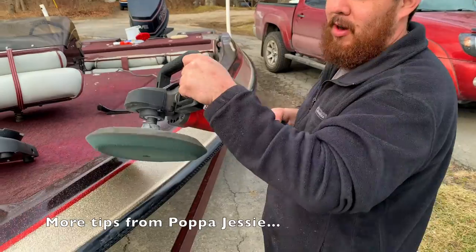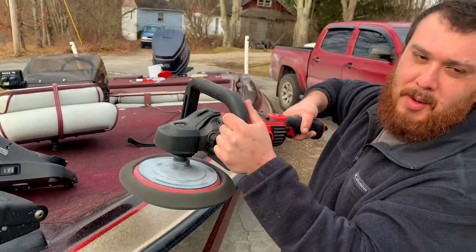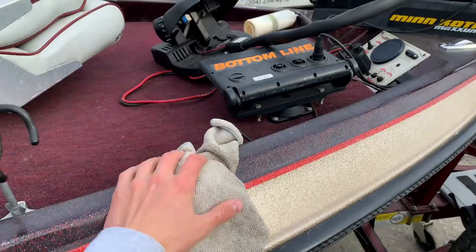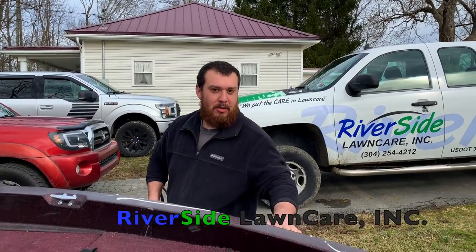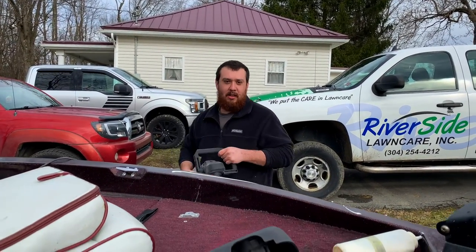See, you want to keep the buffer turning like this. If you keep it tilted like this, you don't want that — or that. Jesse, we forgot to mention a damp rag. Why do I need this damp rag first? You got to get the surface clean. You can't have any particles on it. If you start buffing with stuff on it, it's just going to tear things apart and damage the gel coat — it's not going to look good.